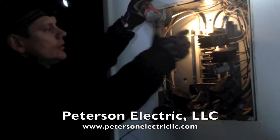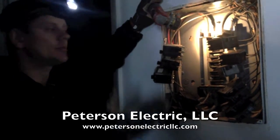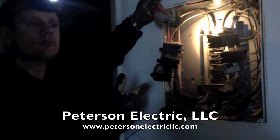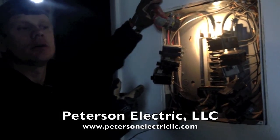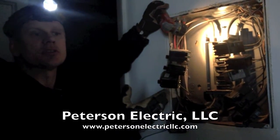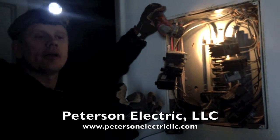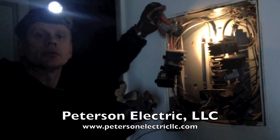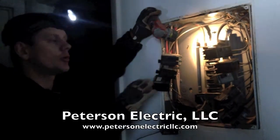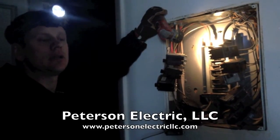The dryer motor and heater were probably on the same phase, while the other phase — the A phase — probably just did the heater. The breakers were shutting down. The good thing is this is a Square D QO panel, and these breakers don't tolerate a lot of overheating — they'll shut down. Your breaker is designed for overcurrent, temperatures on the wire, faults on your hot to your ground and neutral, but it's also sensing heat. This breaker must have been heating up pretty hot and shut down so the dryer wiring wasn't getting any hotter.